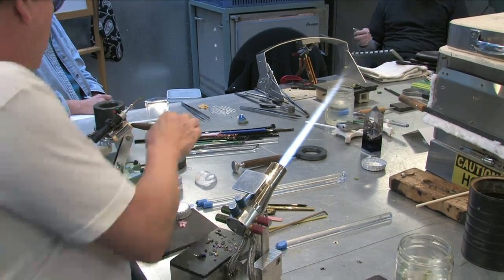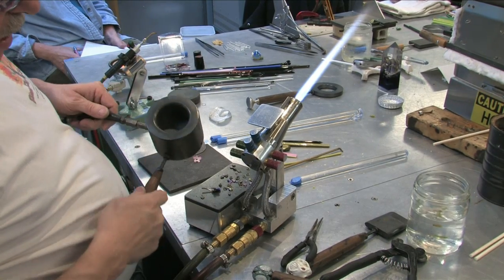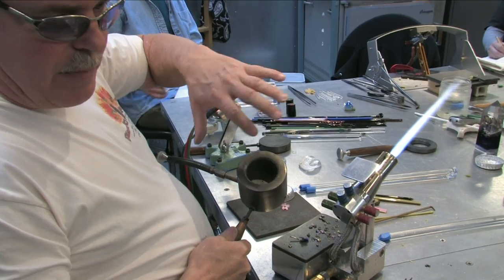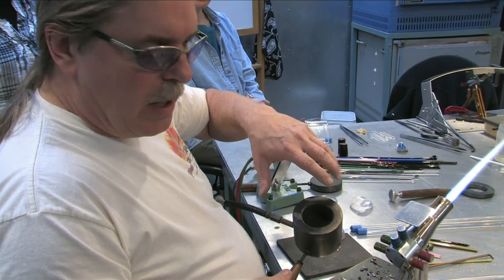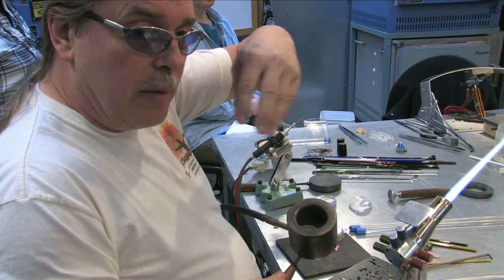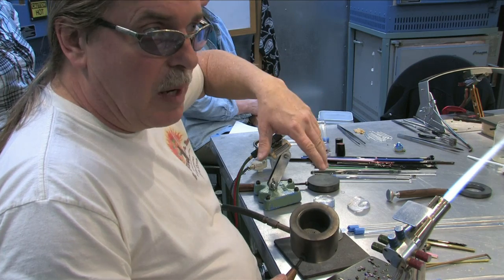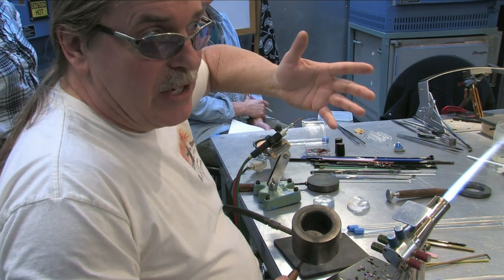The cup, which is hot here, is only about a 2-inch hole. And in order for a full dome, which causes magnification on the paperweight, to magnify that setup, you have to come in about a 1/4 inch smaller than that 2 inches. Otherwise, the magnification will cut off the outside petals and leaves. And if you do that by mistake, you have to drop the dome to make it flatter and flatter to take the magnification out.